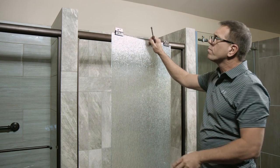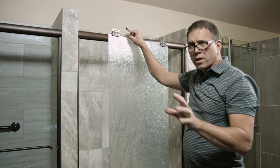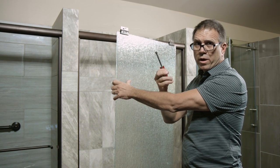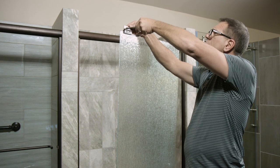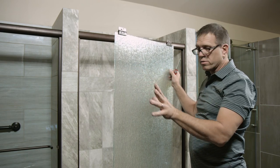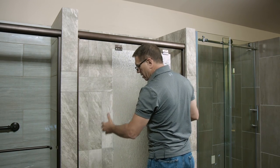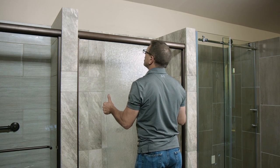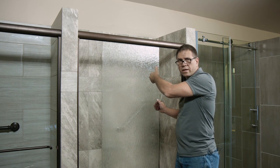For this next step, you're going to need to make sure your rollers are tightened to your brackets. Your instruction guide is going to say to use a quarter inch box end wrench — that's fine. I use a quarter inch nut driver; either one is going to work. Just put it right there and make sure your rollers are tightened down, otherwise they're going to slip on you and you're going to have a problem. Take it, get it close to the frame, and you're going to slip it up and carefully set it on the track — on the inside track, with your rollers facing toward the inside of your shower door.